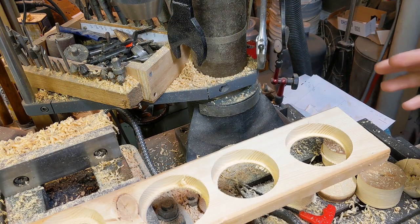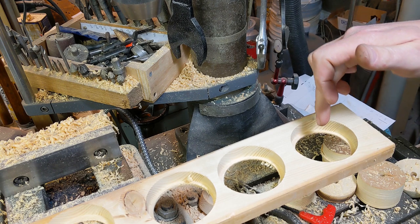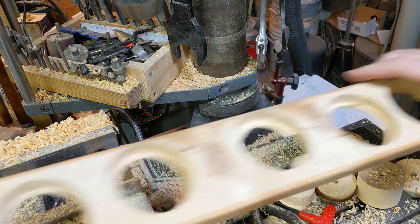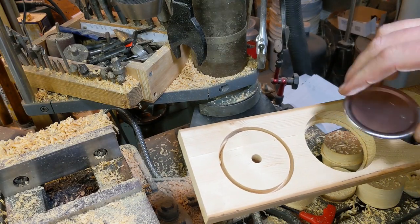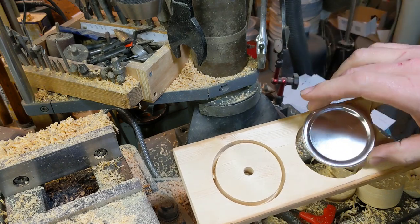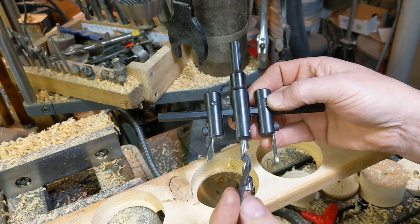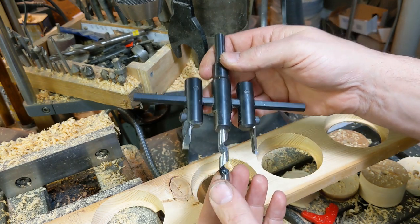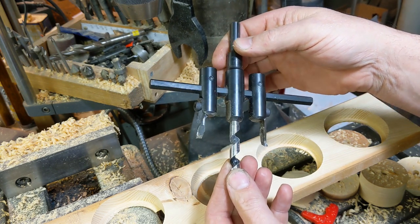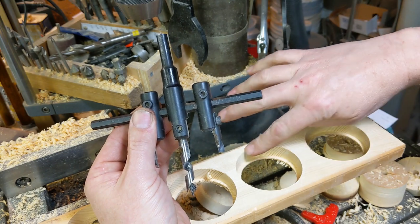Postscript: as I was doing some sample cutting, I realized that my interior cutter was a little bit longer than my exterior cutter, and the result was that the interior poked through before the exterior did. By a happy coincidence, that's exactly what I want — I want the disc to be able to drop into the hole and stop. Having seen that happen, I took out the stock cutters and made some replacement cutters, doing a little experimenting to turn this into a more specialized cutting tool.